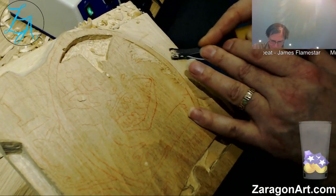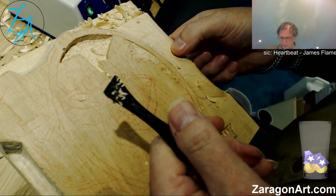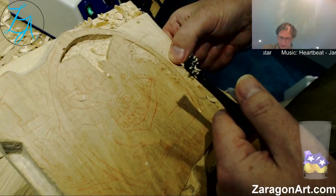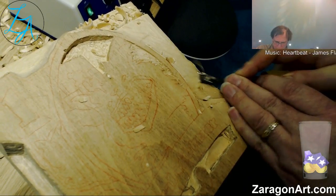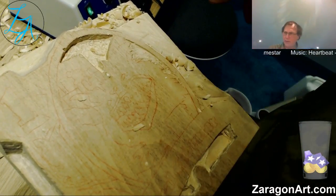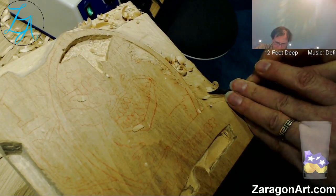Slopes up. So I can feel the thickness of the wood, and I can feel the slope either like that, or doing it this way you can feel your fingers move and you can feel where it gets thicker or thinner. Switch to a slightly less aggressive one there, just because I'm using a bit too much force than I was wanting to.